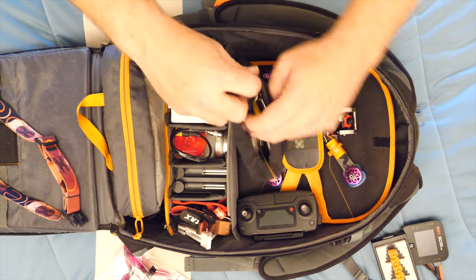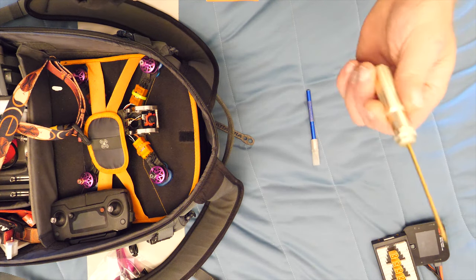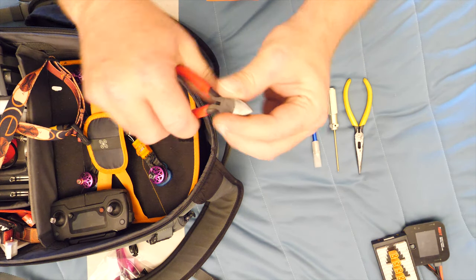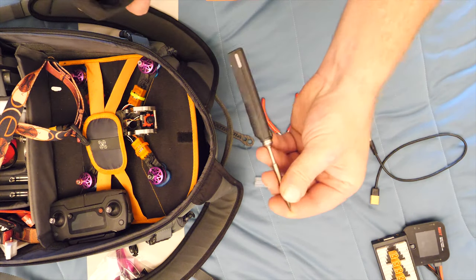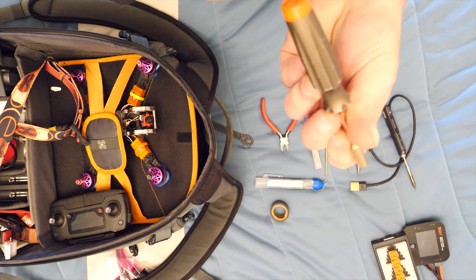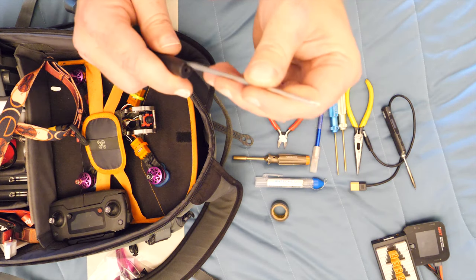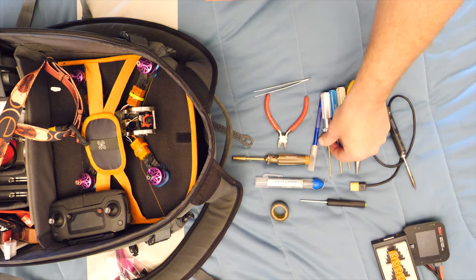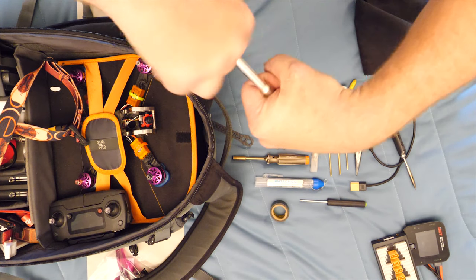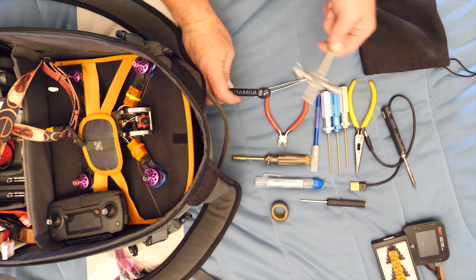Here are my tools - I don't carry a traditional tool bag, just a pouch, which is easier. There's an exacto knife, two millimeter needle nose pliers - probably the most used tool - and always invest in a very nice set of flush cuts. When I say flush cuts, I mean flush - when you close them there's no gap. I also have my TS100 soldering iron, electrical tape, 1.5 millimeter and 5.5 millimeter hex drivers, fine tipped needle nose tweezers, a universal Phillips/flathead screwdriver, and a prop tool with a lot of leverage - probably my most favorite tool.